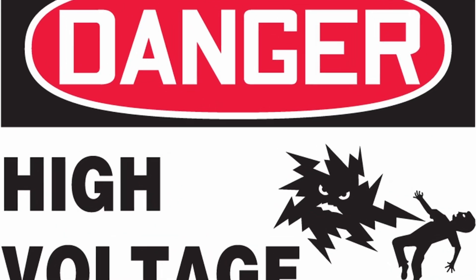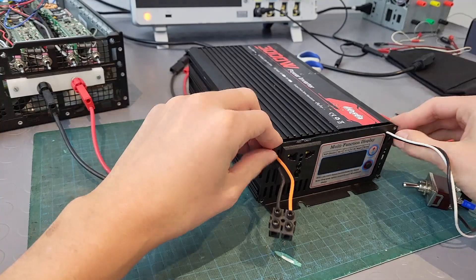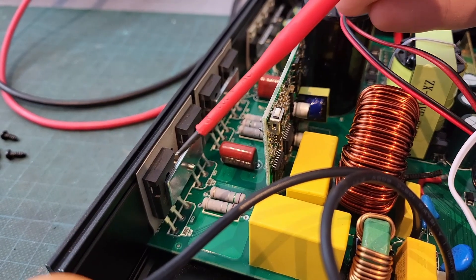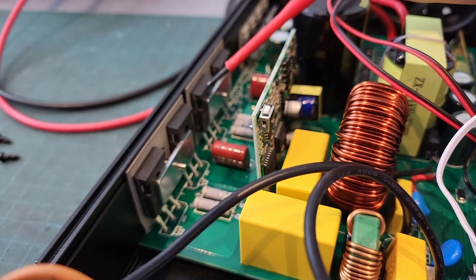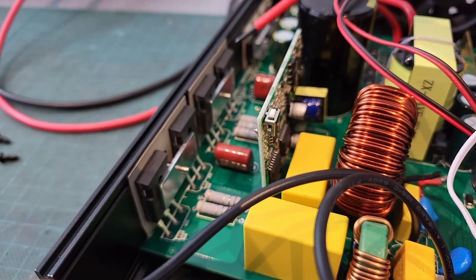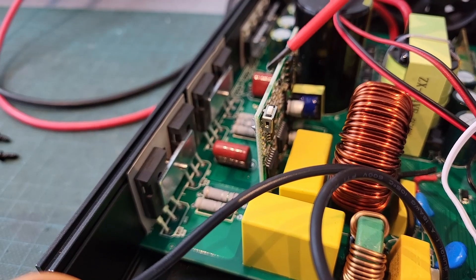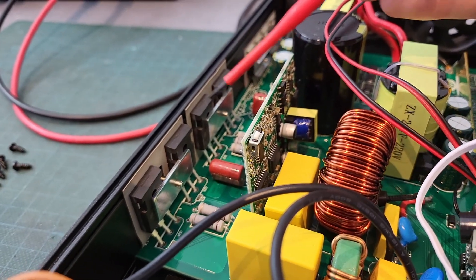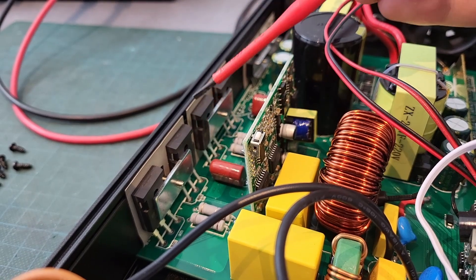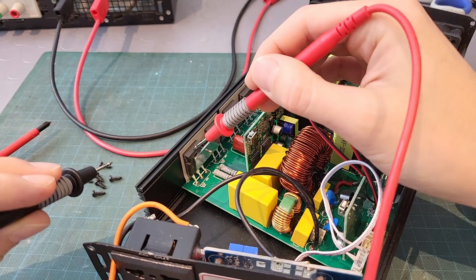Safety first — time to shut it all down and disconnect the power. There's high voltage in there and we don't want any surprises. While opening the inverter chassis, these are the four MOSFETs that form the full bridge. They are responsible for switching the current to create the AC output. This tiny control board sends the PWM signal to the MOSFETs. If one of these four MOSFETs is shorted or not switching, you lose half of the waveform at the output.